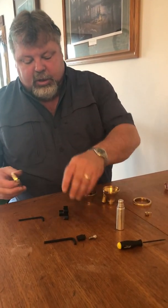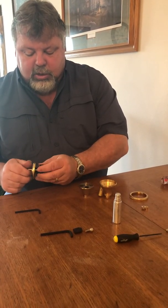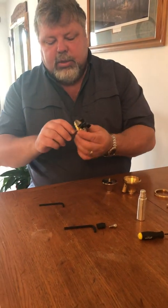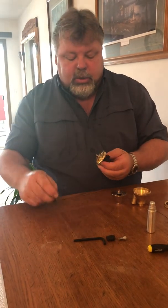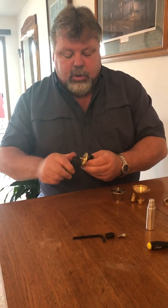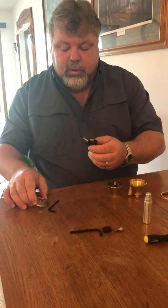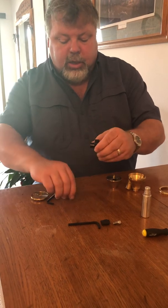From the top, insert the tool in the center and hand-tighten the removal nut. There's a pocket in this removal nut that accepts the bearing. From there, just tighten that screw and you can feel it release — the bearing is out. The bearing ends up in the pocket of the nut.